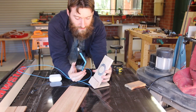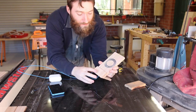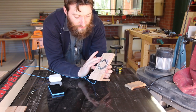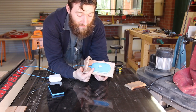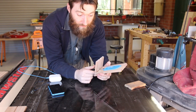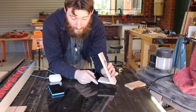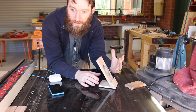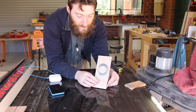The phone stand is done. I think it actually turned out pretty well despite the issues I introduced into it. The epoxy actually looks surprisingly good, other than the bits where it's sanded a bit too flush — a coat of shellac on that would stop the epoxy from seeping into the pores of the grain. The fit is fantastic — it's actually very much an interference fit, so I'd need to pry it out with something. The little feet help with cable management but also mean it's not tippy and vibrations from the phone aren't transferred as much into the desk.